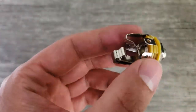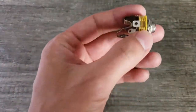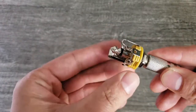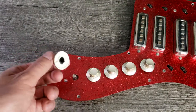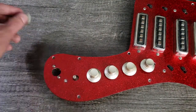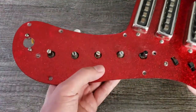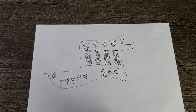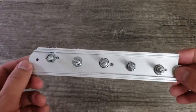I definitely need a stereo socket. But if you use a mono jack, you put one of the channels to the ground. I will alter the schematic to prevent that. The knobs definitely need to be changed. I investigated the schematic, and here is the meaning of the knobs and switches. Now I can solder the new plate. Round first.